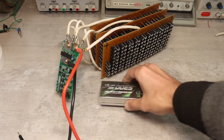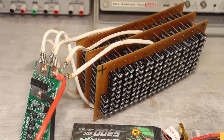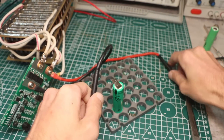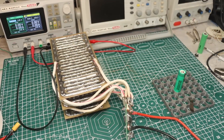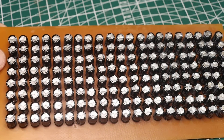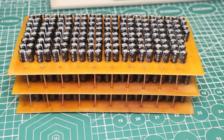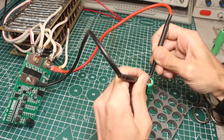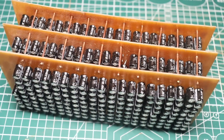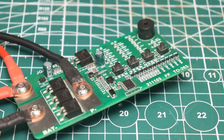I think in combination with a polymer battery with a current output of 100 to 150 Amps, you can get ideal results. Capacitors, due to their lower resistance, will work at the initial moment of welding — providing a huge shock current and piercing the tape — then the battery will finish it. Of course, it is possible on capacitors alone, but you need to increase the energy of the battery 2 or 3 times by raising its capacitance. You can also increase the voltage, but I don't advise this because with higher voltage a slight lack of contact or poor clamping will lead to a big explosion.